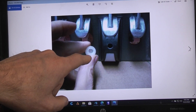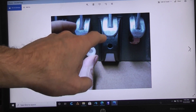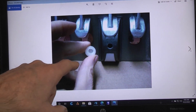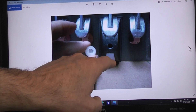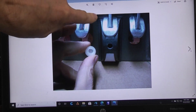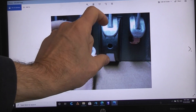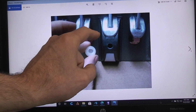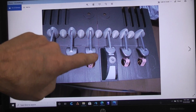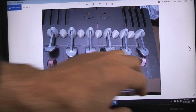There's a little button piece that you can glue into that hole, which we'll use later for the tubing that comes off. When it comes time to glue the sax rests on, set your whole mainframe on something flat like a counter, with the sax rest all the way down on the ground as far down as it can go so it's sitting flat. Start at the center — here's the crack between the left and the right. Line one edge up and glue that one in, then put the one over here and butt them against each other. If you start from the center and work your way out you'll get everything lined up just right. Here's the first one on, glue the next one on, then glue the next one and just work your way out.